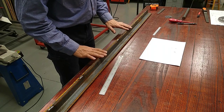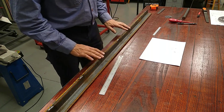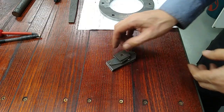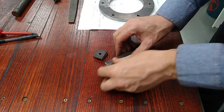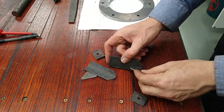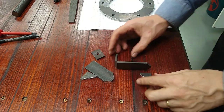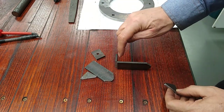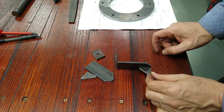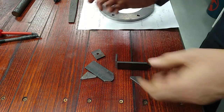Now that I've got a bit of a monorail welded together, I've got to come up with some brackets so I can actually bolt it to the gasifier frame. I just worked these up on the bandsaw - basically something like this. I'm going to weld these to the monorail like so. That bolts to the top of the gasifier frame. There's a bit of a gusset and that welds to the monorail. We'll get them on the welding table and get them welded together.